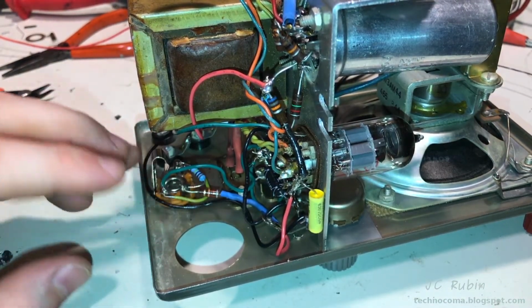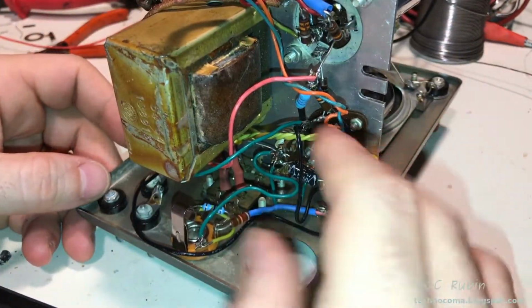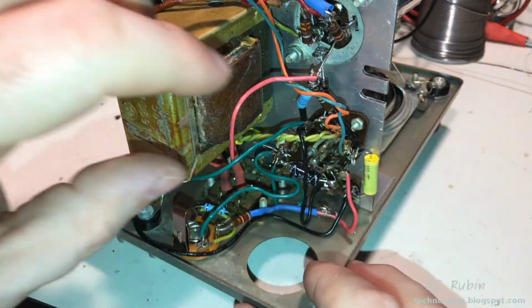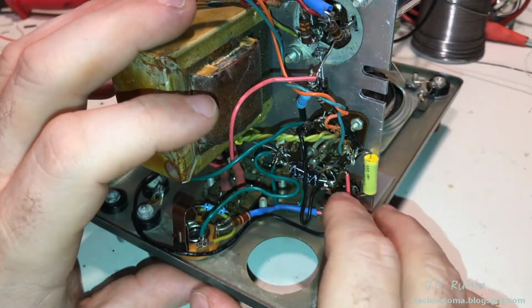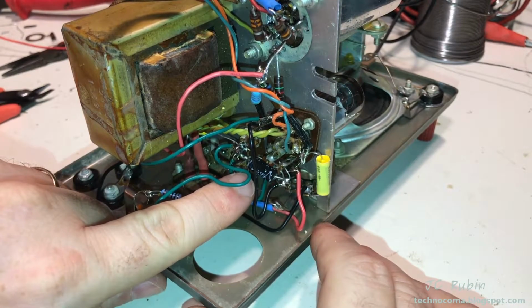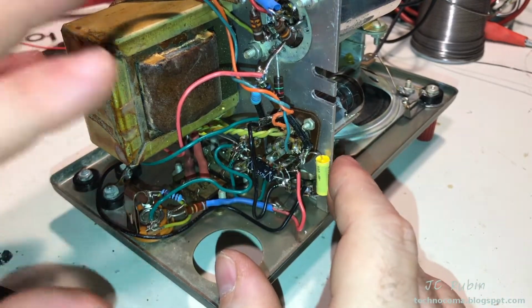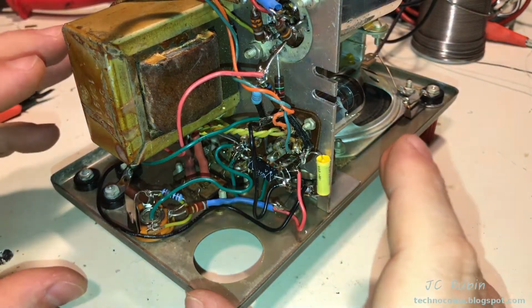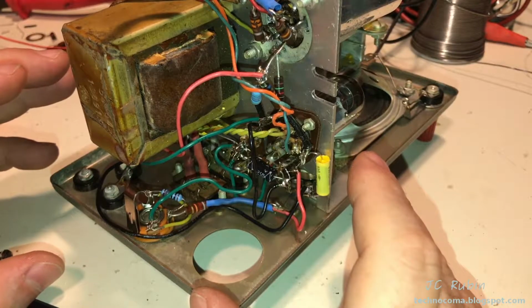All the resistors are in position. And most importantly, what it did was it removed all of the temporary stuff that had to be put in on this side, making room once more for the magic eye tube to be seated here. There is no extra parts save for the components for the cathode bias capacitor and resistor here, and a capacitor here, which has more than enough space. Everything's going to slide in just fine. So with everything that's been done so far, the fitment should be okay.